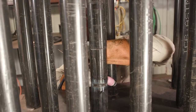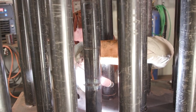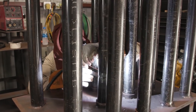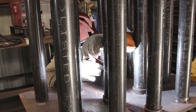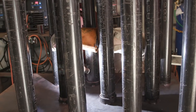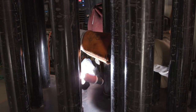Whenever you're doing these types of welds, you always want to make sure you're comfortable and you're nice and sturdy, because these are real tight welds. The reason why I like using 3/32 is that you could just keyhole it in there. You just let it drip and it falls right in there, kind of like whenever you do stainless. And like I said, notice the rod's on the top bevel, just dripping it in there and bringing it down, opening up that keyhole.